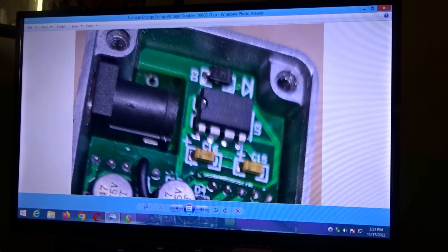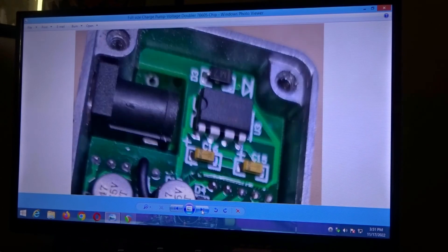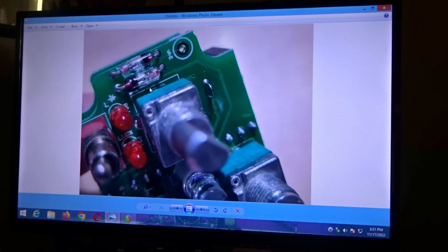The pin orientation — you can see this has a little cutout, and it shows it here on the board, as does this one here. So we're going to take a look at another picture, and this is the silver horse. These are the diodes up here and these are the LEDs. The way the toggle switch works — and what makes me think people are getting confused — this is in the up position. Just because it's pointing up toward the diodes does not mean those are in use. Actually it means the LEDs are in use. If you flip it down, that means the diodes are in use. And that's why it sounds better in the downward position to me.